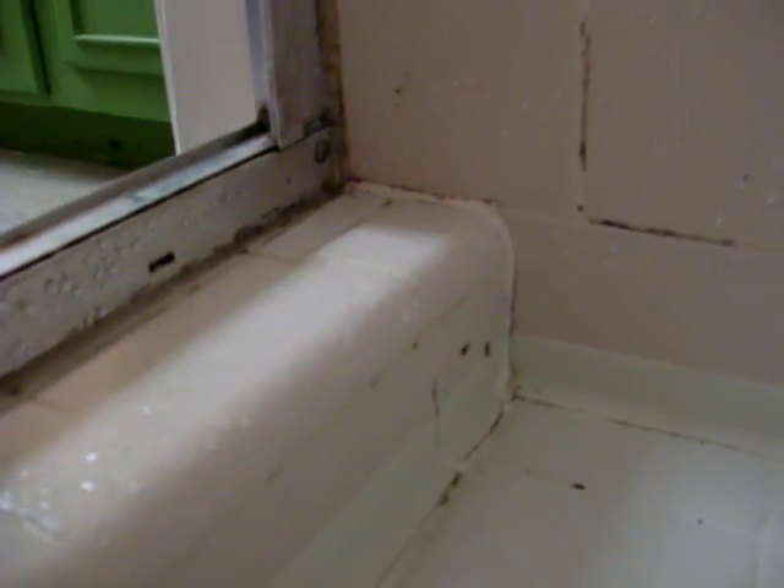To help find out if the pan is bad or if some other potential problems exist, I put a stopper in the bottom for it to hold water, filled it up to where it's about an inch below the shower pan, and then you allow that to sit for a while.